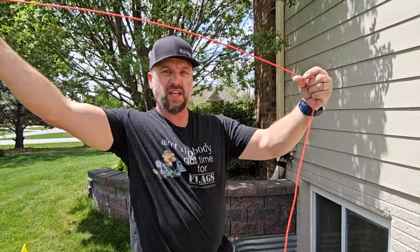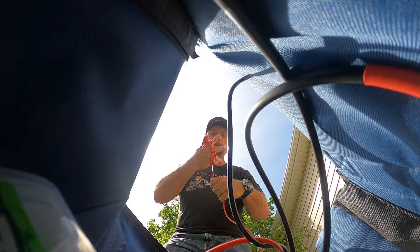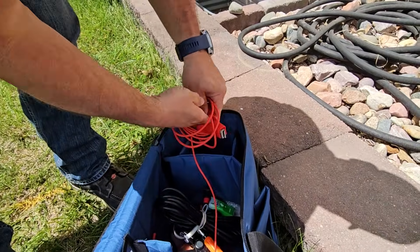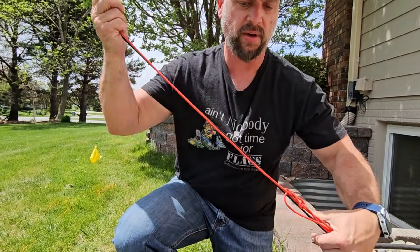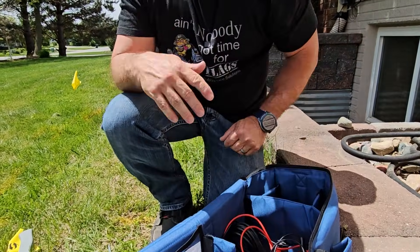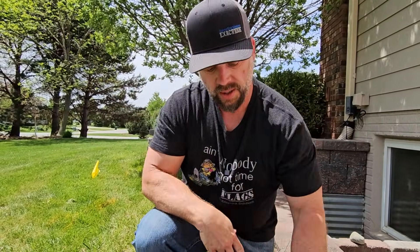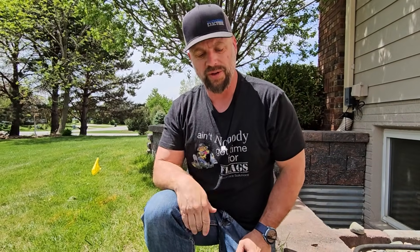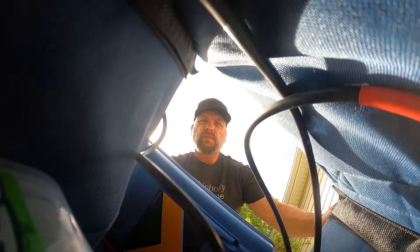A common question: how do you keep these cables from tangling? Wrap them up separately and stick them in the little pockets on the side, then pull them out one at a time at your next locate. Another option: clip them together — let them 'kiss' — and wind them up so they're somewhat separated. If you're totally tired of them tangling, you can order curly cables. I like the reach of the 20-foot cables to get the ground far away from where I plan on locating.